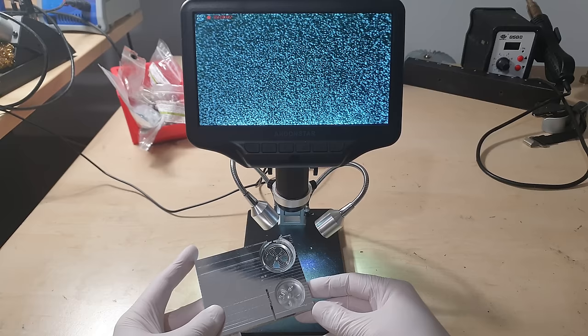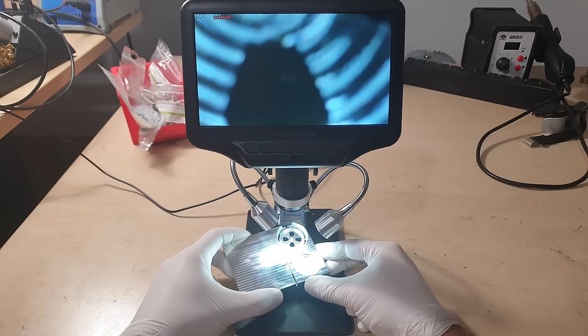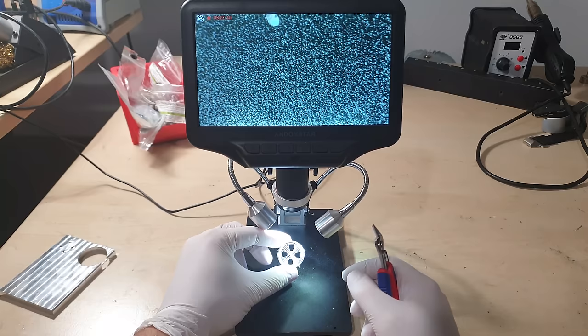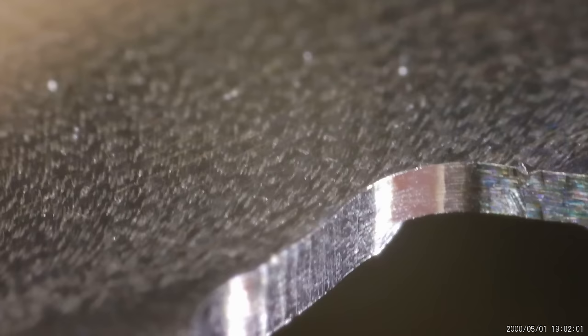Alright — how and especially what did we do? Is this some kind of bling alloy wheel for a 200-micrometer axle? No, it's a fiber lapping puck. In a long-ago fiber-coupled laser video I tried to polish a termination by hand, which resulted in rounded corners and subsequently a burning termination. This thing will hold fibers perfectly square while lapping, and that will hopefully result in much better terminations and a few more fiber laser adventures.